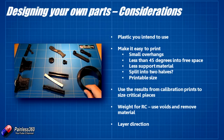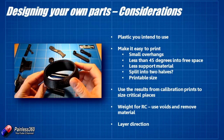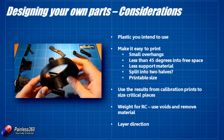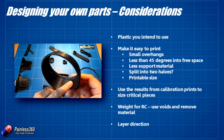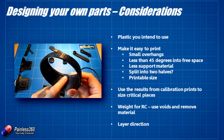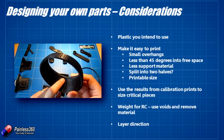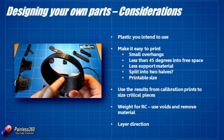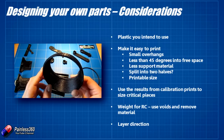Consider having less support material. This one was printed with that side as the bottom and this as the top, and most of it was fine. The only problem was this very top piece — I've had to finish that up with a little bit of sandpaper because there wasn't any support material there. I thought I'd get away with it, but I didn't. If I was going to print this again, I'd probably add a couple of little nubbins coming out from the wall further down to act as integrated support, and provide a bit more mechanical strength when it's on the model.